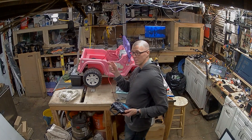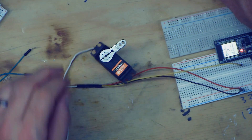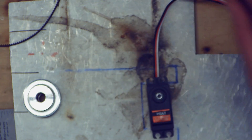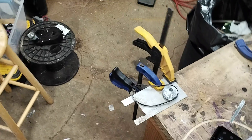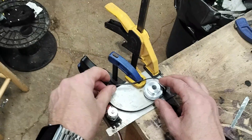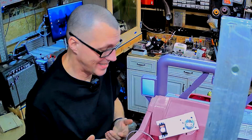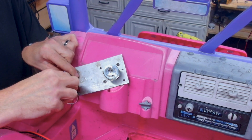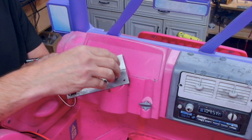Now we've got to put a servo on the front on the steering wheel. I haven't used servos that much in projects, but the ESP32 has a really cool library called the MCPWM library that lets me make them jump around. Eventually I figured out how to use them. I thought it would be trivial to have a pulley with a GT2 timing belt to control the steering wheel. Version 1 looked like it would work — it entirely didn't. It bent forward, it skipped every belt step, the shaft of the servo motor was bending, the aluminum was bending. Everything about it was bad.